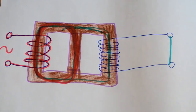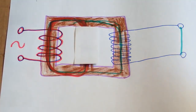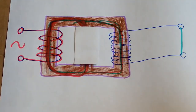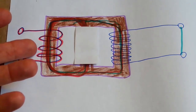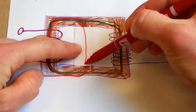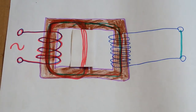A normal transformer with no magnetic shunt will have a very high short circuit current. When shorted it will probably trip a breaker, blow a fuse, or overheat. The AC magnetic flux from the primary has no other way to go than through the secondary, resulting in very high overcurrent. In a normal transformer the short circuit current is limited mainly by the resistance of the windings, which dissipates quite a lot of power. Forcing the magnetic flux through a long air path requires quite a high primary current, so it may overheat.